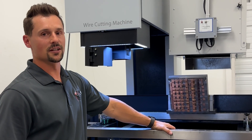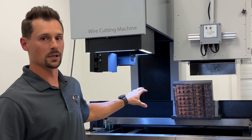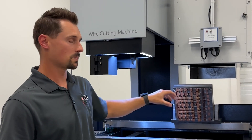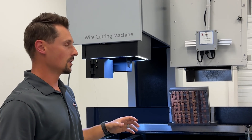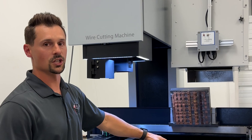Another key advantage of our tilt and slide fixturing setup is the fact that you can run multiple build plates on the same setup. So if you have a 10-inch and a 12-inch plate, or three 10-inch plates, we can customize the pivot table and the fixturing setup so that you can get extended overnight burns or run multiple plates at one shot.